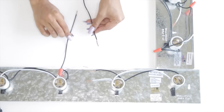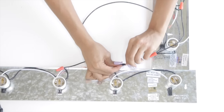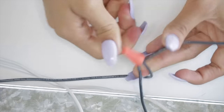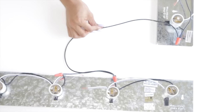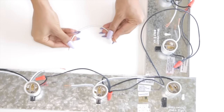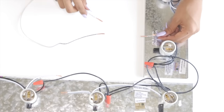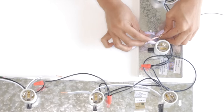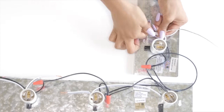I have the mini extension from the middle light strip, the long extension from the right light strip, and the exposed wire on the middle light strip. Taking those three, I want to twist them together — and my personal rule is I didn't want to exceed more than three wires to one connector because I didn't want the wires to get too hot. We have the black wire from the side vanity strip connected to the black wire from the middle vanity strip. Now we need to do the same exact thing for the white: take the mini extension connecting it to one of the wires on the side light bar, then take the two exposed wires from the side light bar and connect those to the extension. When you connect these together, make sure all the wires are completely intertwined, then use your wire connector and twist all the way until you feel it tighten.